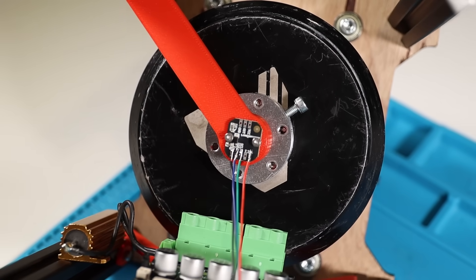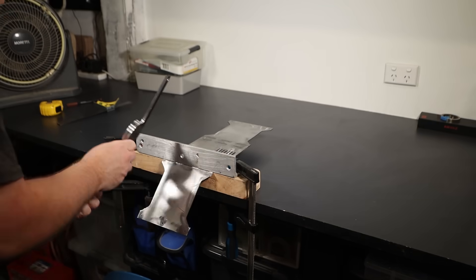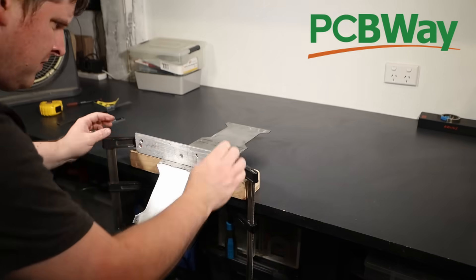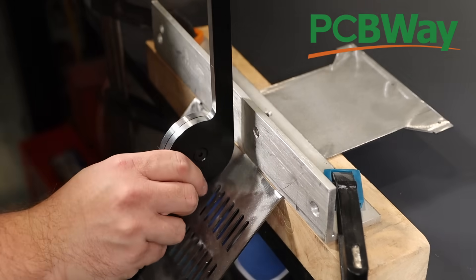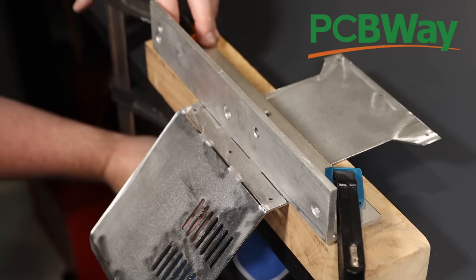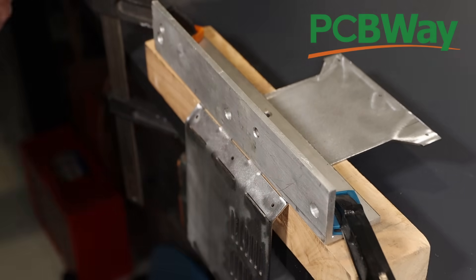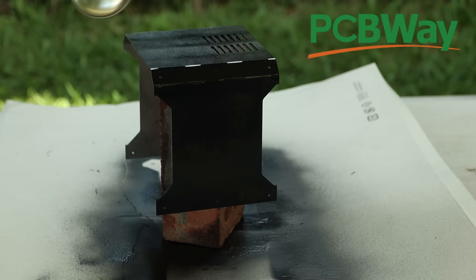With all of that sorted, I'm now safe to finish off the cover for the box. Since I have access to a fiber laser I can just cut and fold my own. But if you want to do something like this and don't have a way to do it yourself, PCBWay can also do sheet metal fabrication — you'll need to upload a 3D file of your part, a 2D drawing for the profile cutting, and a technical drawing to specify the location and angle of the bends. Then just select your material and any other options you want and away you go. PCBWay are a sponsor of the channel, so check out the link in the video description for this or any other service they provide.